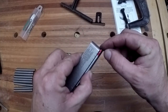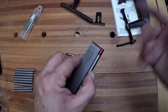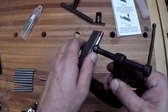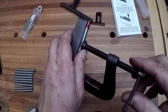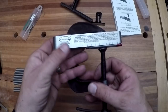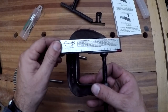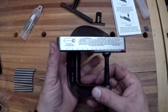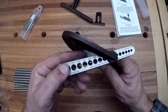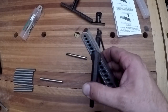Let's take our V drill guide and get her set up. It happens to work out nicely - I need my hole a quarter inch from the end, and the first hole measurement is exactly one quarter from the end of the tool. That works out kind of nice - one of those jobs you need three hands for. A lot of guys use these without clamping, but it does say on here to make sure to clamp the tool. I also misspoke - it says 'oil frequently to prevent rusting,' so maybe this is not rust-resistant steel after all.